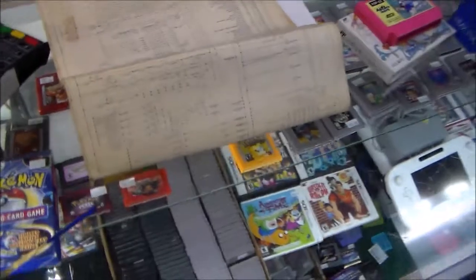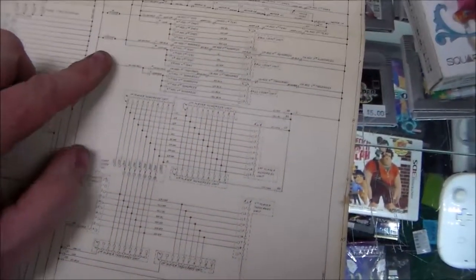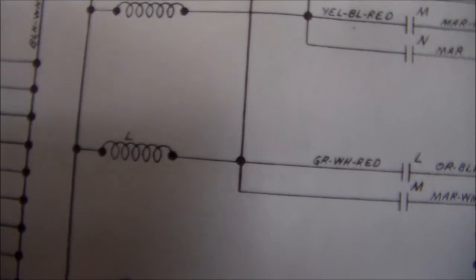All right, folks. So that one took a little sleuthing. I'll show you how I kind of tracked it down. Now, people that are really good with these could probably just tell by looking at it what's going on. But I'm not all that great at it. So what was our problem? We had the 100 point relay locked on, which is the L relay. So this relay was stuck on and we were not getting 100 points, right?